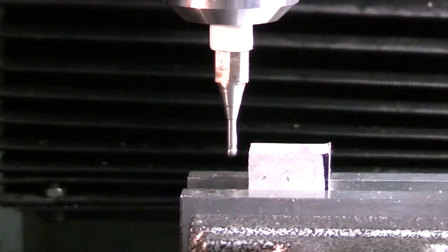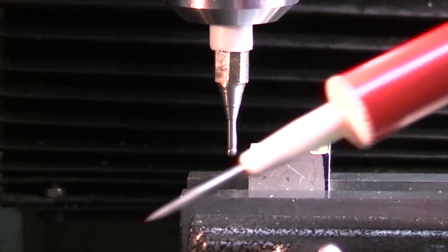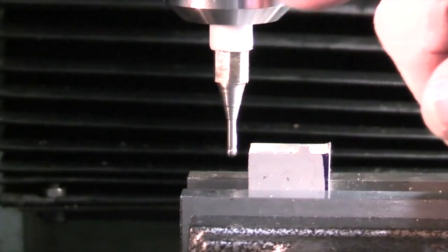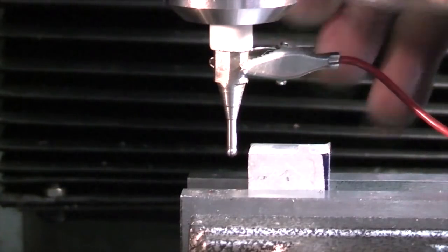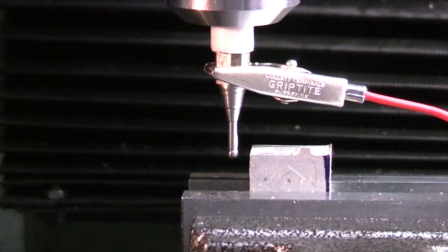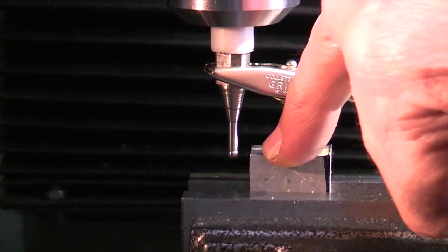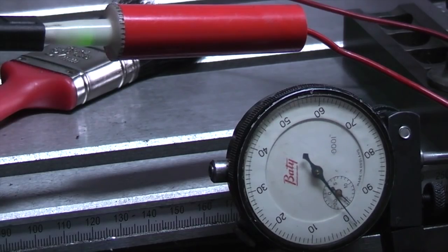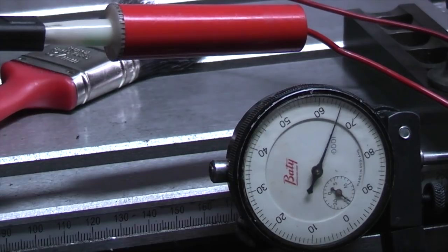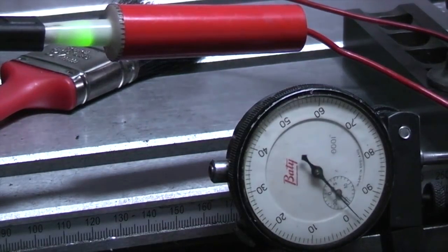Now what I'm going to do with this is I've got this electrical tester - all it does is when you join the two wires together a light comes on. So because this is now insulated, if I clip one wire onto the milling machine and the other wire I'll push into the crocodile clip and click that onto the device. Now what should happen is when the probe touches the edge of the aluminium, the light should come on - so we'll look at the light and the dial indicator. When I move it out and come back in, I'm looking at the light - just glowing. Touch it there - you can see it's lit up. The dial indicator is two and a half tenths from zero.